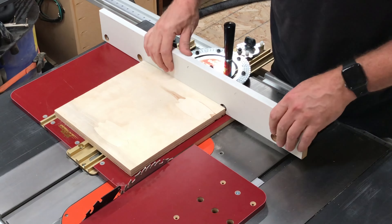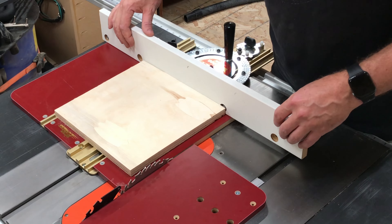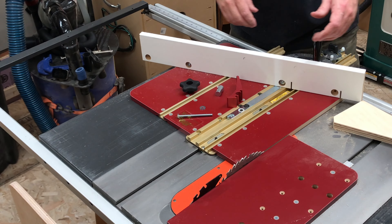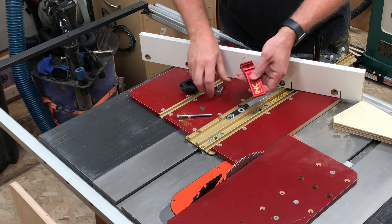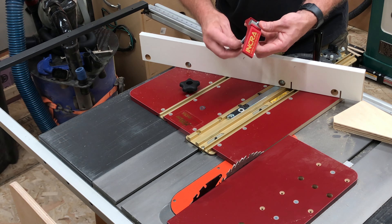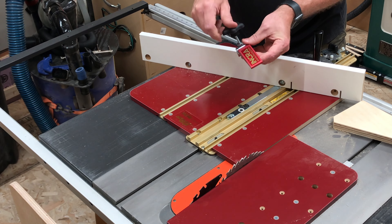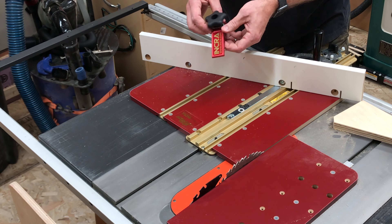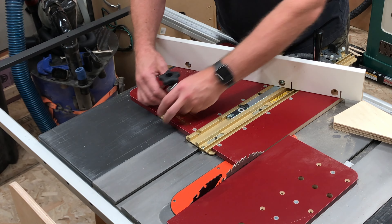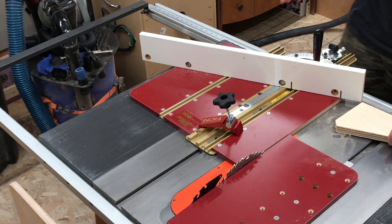Off camera, I made an auxiliary fence from an MDF trim board. The instructions detail where to drill the holes, and the kit comes with hardware to attach it to the fence. One more feature is the hold-down clamp — it comes with five pieces: slides in the slot, bolt up through the bottom, washer over the top, star knob down on top. Now we've got material hold-down in either slot — let's use the one closer to the cut.